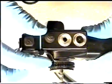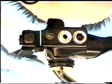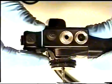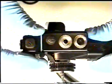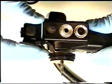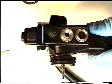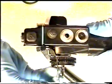There are 2 sets of rings. In order to loosen the tightness on an Olympus scope, these rings move independently. You'll need to unscrew this ring counterclockwise to loosen the stiffness of the knobs. Be sure to match the grooves when reapplying the knob.